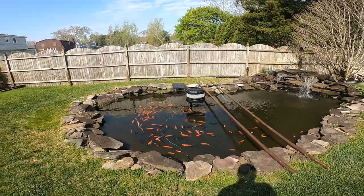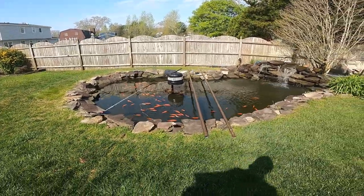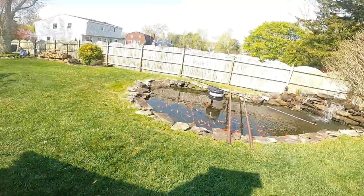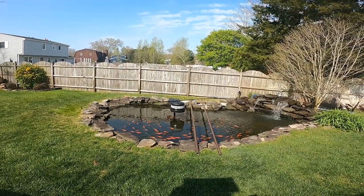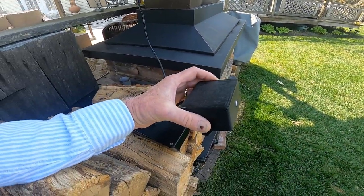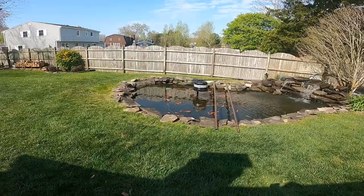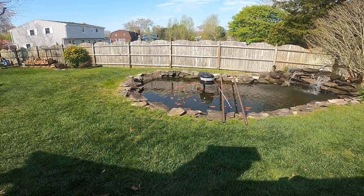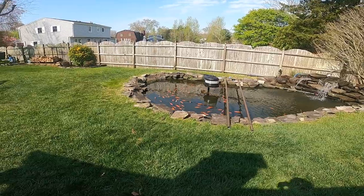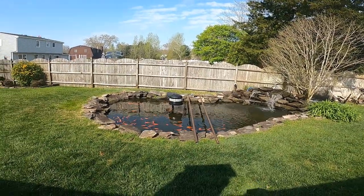This is inspired by — I think — Space Balls. That kind of looks like a helmet right there. Eventually I would like to take this controller here and use — since it basically uses pulse width modulation to control the speed of that motor — the little ESP32 controller that is in this box, which can actually accomplish that same thing. It wouldn't be very difficult to write a program to control that and change the speed, and then use only one ESP32 for everything, and at the same time I could write it to be able to do it via the network.